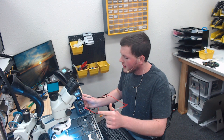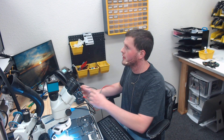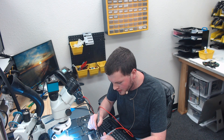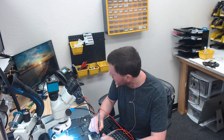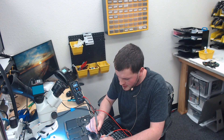So if you get 54 volts, or 50 or 45, whatever, your issue is the screen - it is not the board. Do not mess with the board. I've had people that have gone high and low replacing everything in the circuit only to find they have a bad screen. Don't do that. Measure first. So we have zero volts. Zero volts can also mean a bad screen, or it could mean that something's up in the circuit like a short.